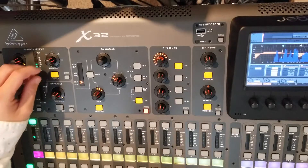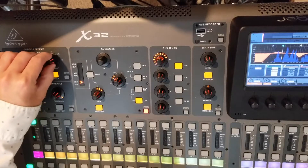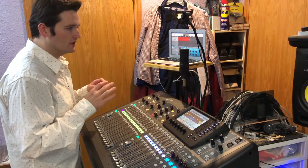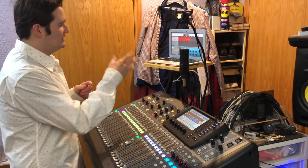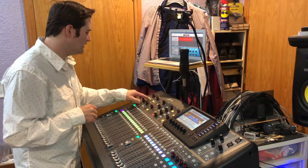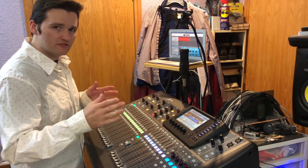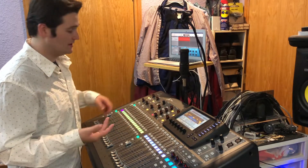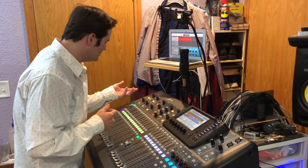The next one is low cut, which is actually part of the EQ. Right now it's activated. I believe the signal — right after the preamp takes the low-level audio and boosts it up to a usable level — goes directly to whatever you're using to record off-board. I don't think the low cut or anything after it affects that off-board recording path; the phase might, but the 48V isn't really in the signal chain in that sense.